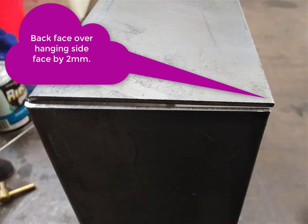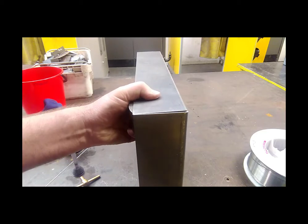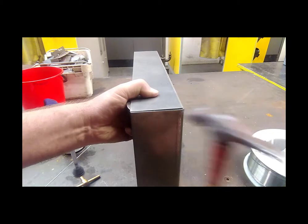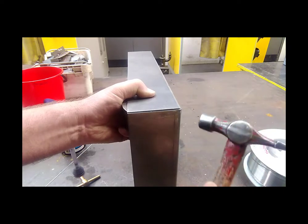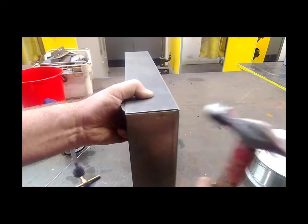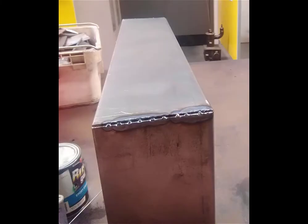You can see here on the screen that the two top faces of the ash pan don't meet up — that's what happened when I folded it on the press. Correcting it with a steel dolly with a square corner hard into the base and using a cross pane hammer to drive the material around the corner to actually line the two tops up. I've got it leveled and tacked it together with the TIG torch.